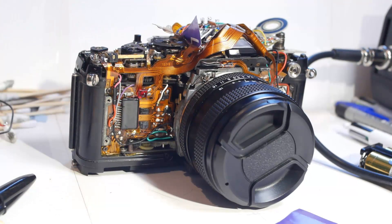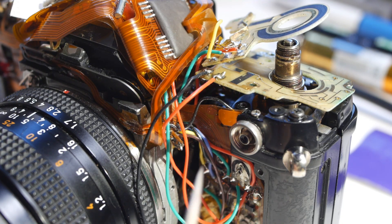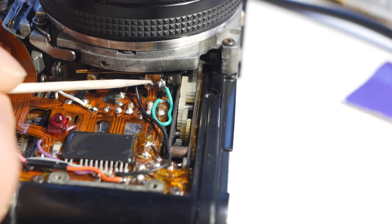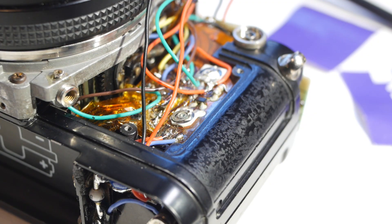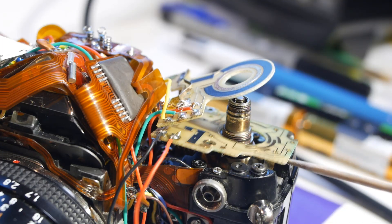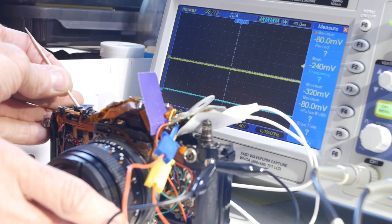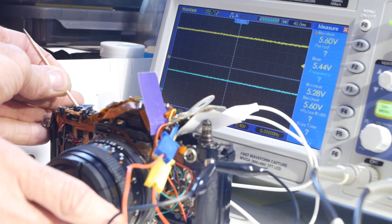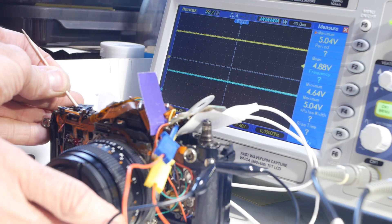And as if by magic it's sort of back together again — we've gained a few more non-original wires. This red and green pair come over from IC1 to replace the broken tracks on the ribbon section down here. Then there's another pair down here that come from the trigger switch. I'd already inserted this pair before, which brings battery power up to the shutter speed PCB. So now I'll make sure there are no obvious shorts, and maybe try powering it up again with the oscilloscope attached.